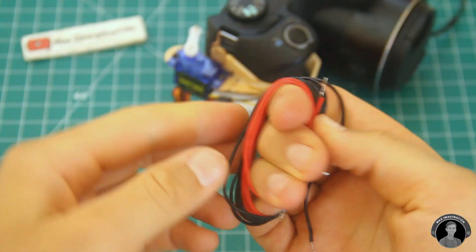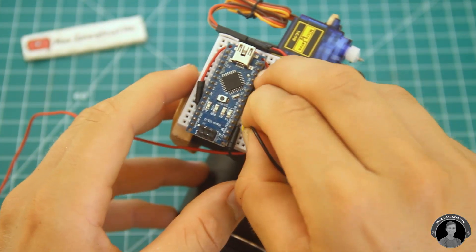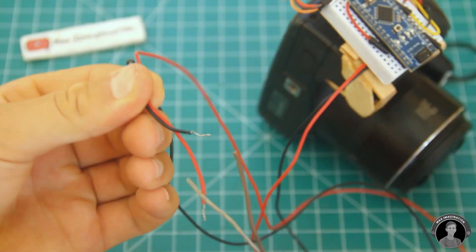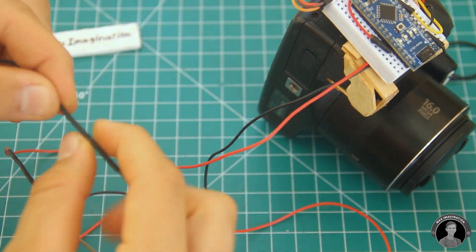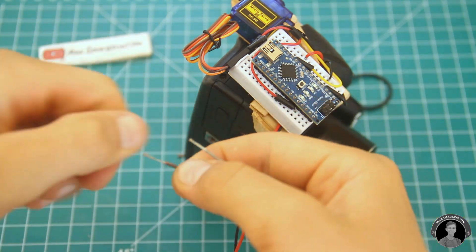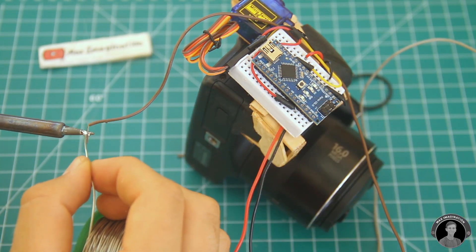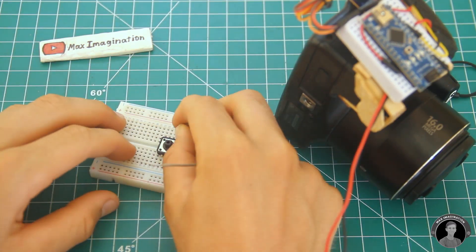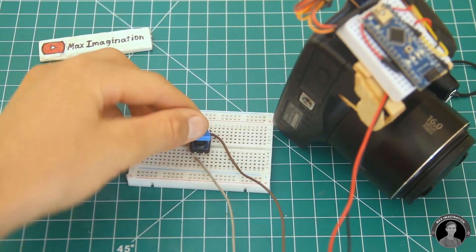Using two rolls of 24-gauge wire, connect the red one to digital pin 7 and the black one to ground on the Arduino. If your two rolls of wire weren't long enough, just solder some additional wire long enough to touch the floor. Strip the ends of those two wires and add some soldering tin to stiffen them up. Stick your push button into a breadboard, connect the two wires to it, and you can even add one of these flat push button knobs.